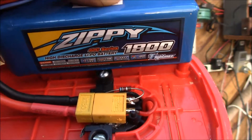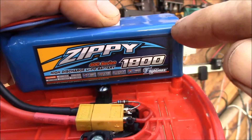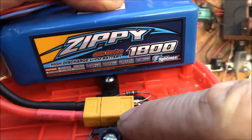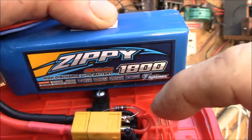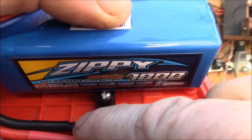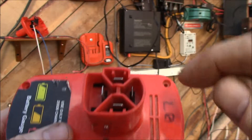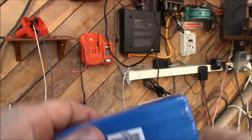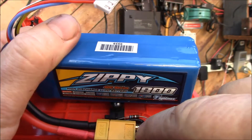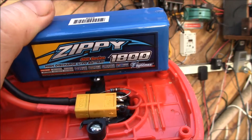Here is my prototype C3 lithium to LiPo — a lithium polymer pack that I'm installing in a lithium ion battery case. I've added an XT60 connector to plug the LiPo pack into, and to make the pack chargeable on the Craftsman charger, I added a 6800 ohm resistor between the side post — the right side post labeled T2 on the circuit boards — and the negative terminal. That's all that's needed for charging.